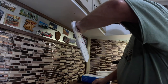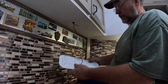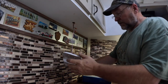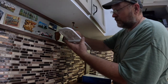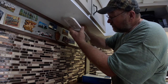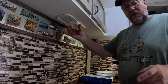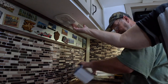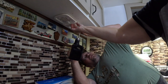All we have to do is hook our two wires — we have a red one and a white one. I'm going to take the red to the red, and the white one goes to my black one. We'll put a wire nut on the reds together, then connect the white to the black. Get the wires into the two little chambers and the wire nuts into the big opening, then we'll put the screws in.